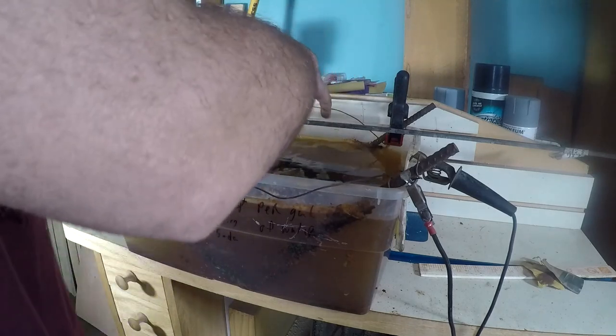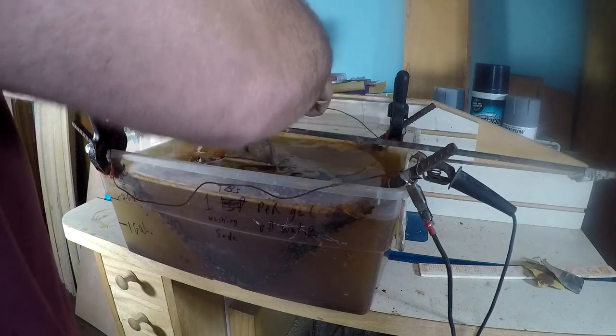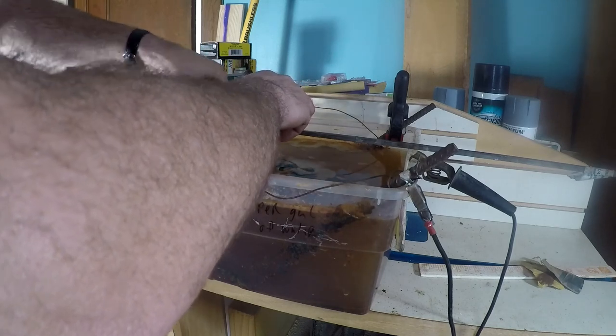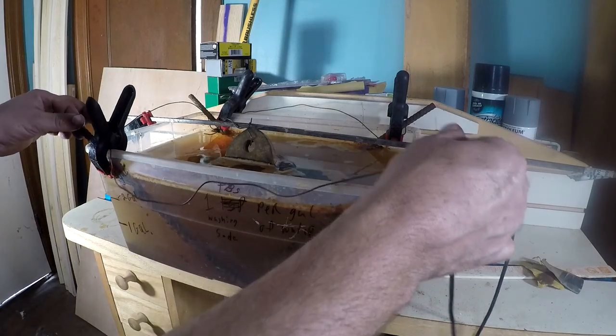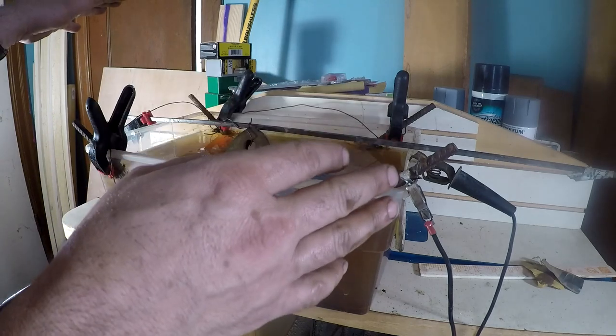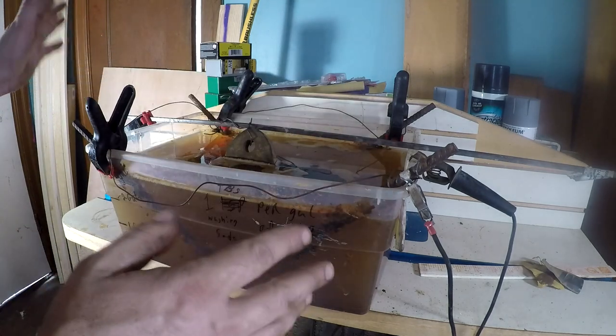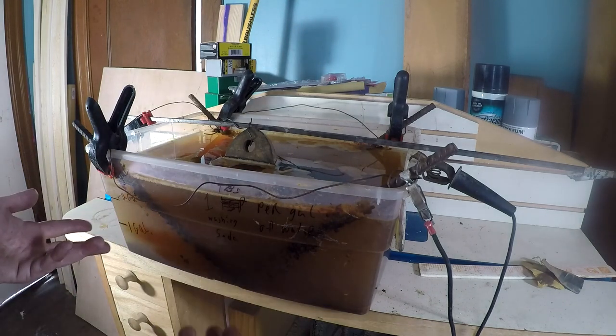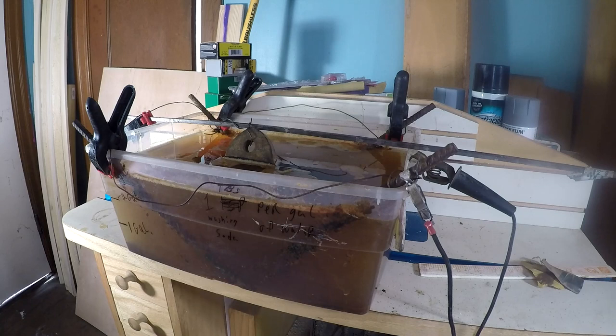Of course, most of it's in. I'll bring this over here and hook this onto that. So the negative goes to the part you're going to clean, positive goes to these electrodes — I've got pieces of rebar and some steel wire. Try to keep water away from this system; it's okay as long as the copper isn't in the water, but you can start leeching copper into the system, and that's bad.